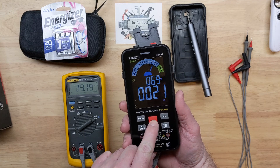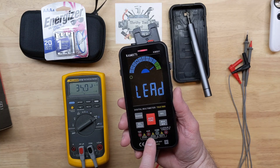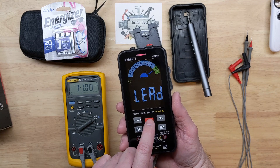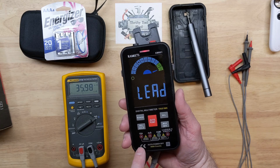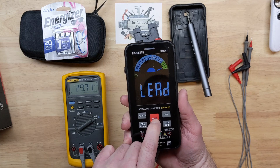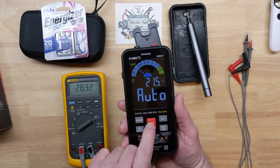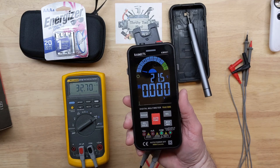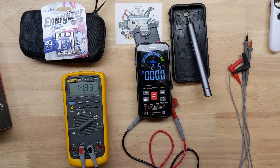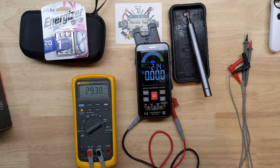Going through the functions, it's a tad bit higher on the milliamp scale. On the amp scale we're at about 31, up to 35–36 milliamps with the LEDs blinking for the jacks, and back to auto it fluctuates back and forth. For an easy number to calculate, let's call it 30 milliamps.